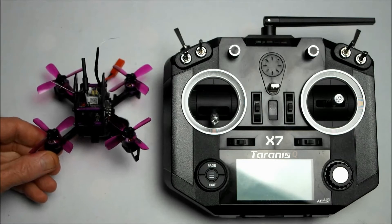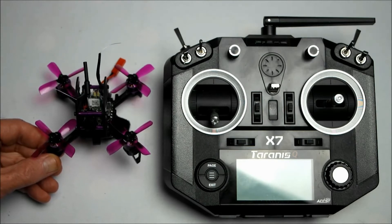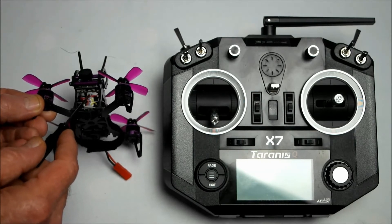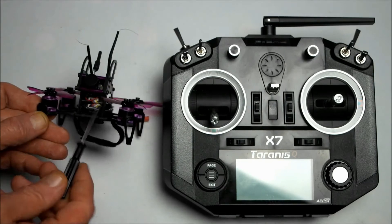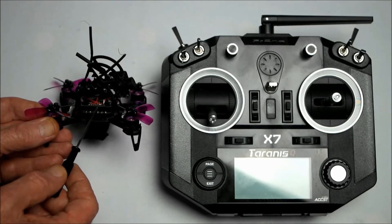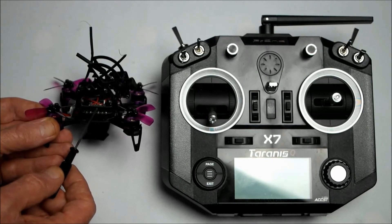After setting this up and testing, I've unfortunately discovered that there is no OSD. This is quite disappointing considering the FC board has integrated OSD, but it came with an incompatible camera — the camera only has two wires for power and no cable for video or OSD. I will be replacing it with a compatible three-wire camera and soldering the OSD onto the board. Since it also doesn't come with an instruction manual, I'll put links in the description for more detail about the FC board and ESC.